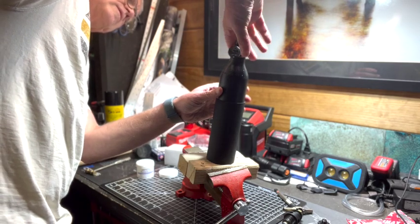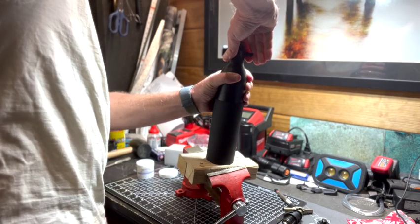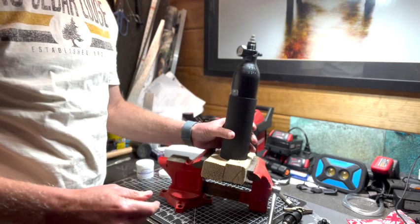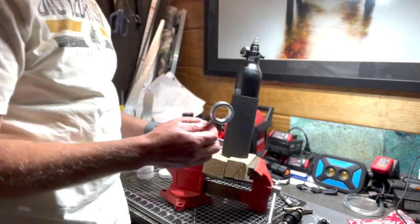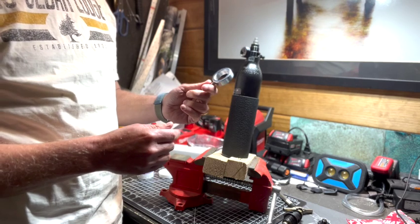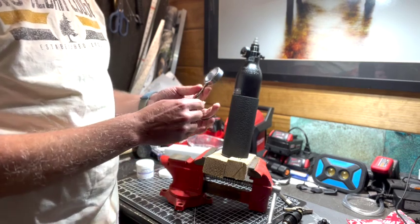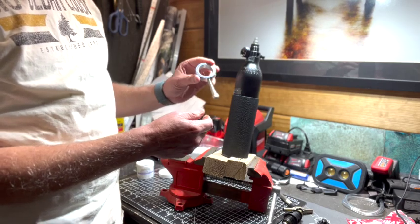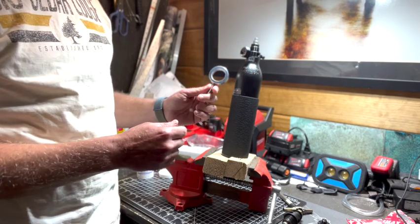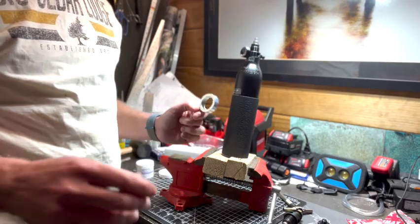There is an o-ring with this, and I'm just going to hand-tighten it. That's it — I think that was pretty easy overall. You have to have the right materials to do this; the shaft collar makes all the difference. You can find these online as valve removal tools, but you'll pay a whole lot more — at least twice as much — compared to just getting your own one-and-a-quarter-inch internal diameter shaft collar. You also have to have the bolt, as the grub screw certainly wouldn't work. Pretty easy — very happy that was much easier than I thought it was going to be. Hope everything goes well for you — thanks for joining in!